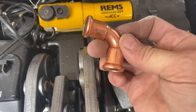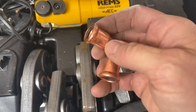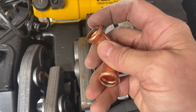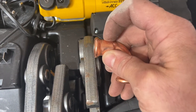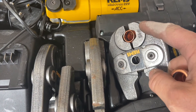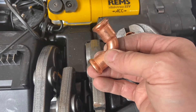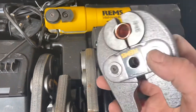This is an M profile press fitting — you see we've got the o-ring but we've not got any copper after the o-ring. The downside to that is the o-ring can get damaged easily, and it only presses twice: once on the o-ring and once on the fitting. You can't press an M profile fitting with a V profile jaw — you need a specific jaw for the fitting you're using. Most importantly, check what fittings you're using and use the correct jaw.